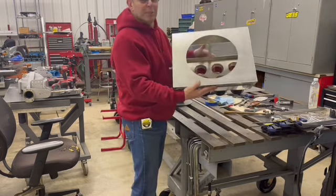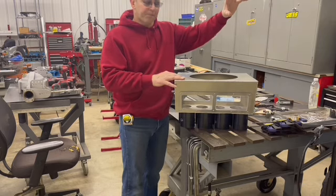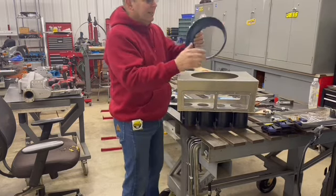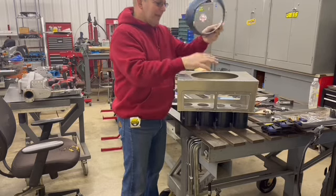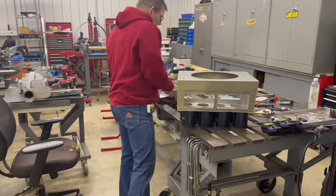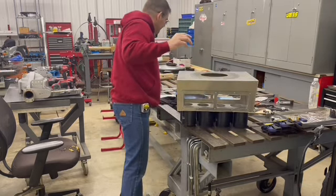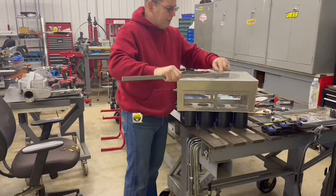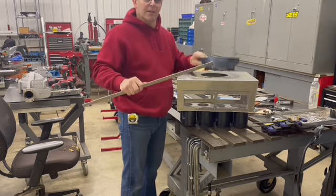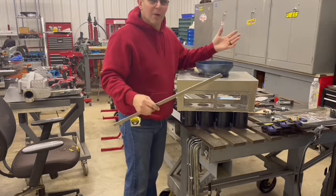When I originally built it, I thought that the intake tube, the ductwork going to the dyno, was this big. I was wrong. It's this big. So I'm going to make this attach to this, and this attaches to that ductwork. I have this piece, which is going to get welded on. Then this piece is going to be bent around this hole, and then this slides over it, and a clamp goes around it and clamps it all together. That's the next thing I've got to fix to get our process going.